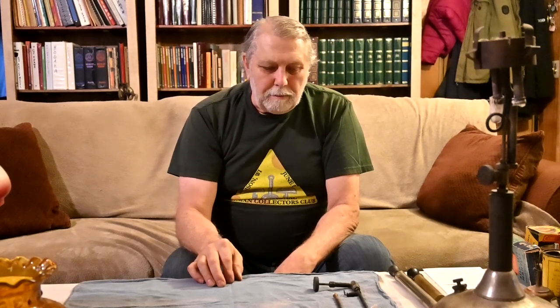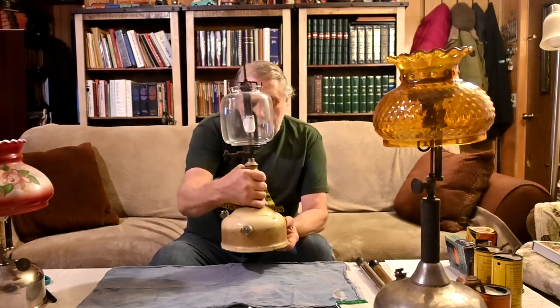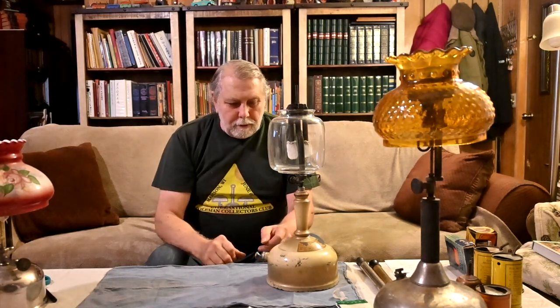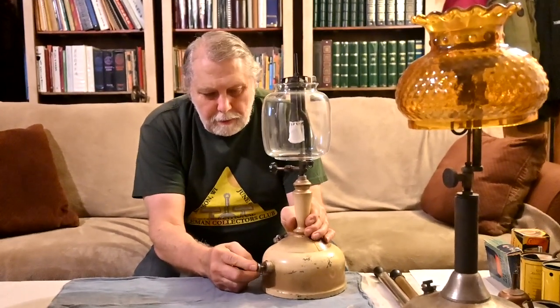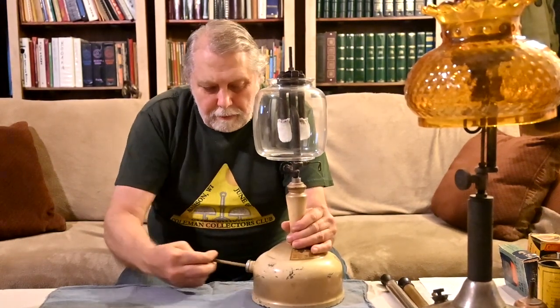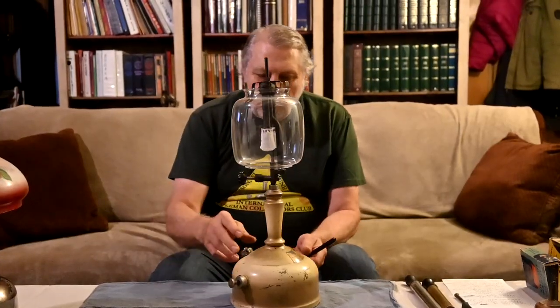It's amazing - the table lamps were made clear through 1971. This is the one we're going to light today. It's a model 152, made in 1943, and it has a number 355 Coleman globe on it. It's got fuel in it and the cap is tight. This is your pressure pump - you open these one turn, there's a hole right here, cover that up with your thumb just like you do on modern lanterns, and get about 50 pumps in. Okay, we're ready to go - got it pumped up and the valve closed.